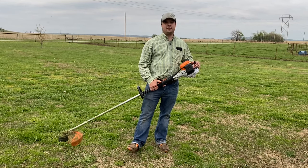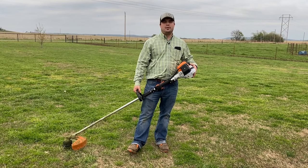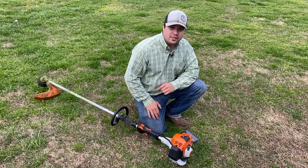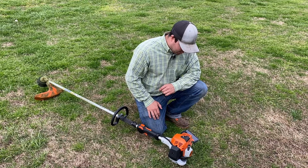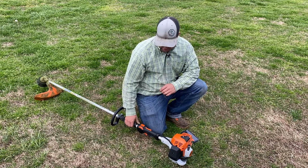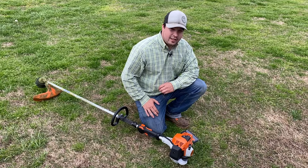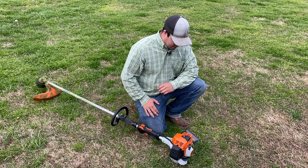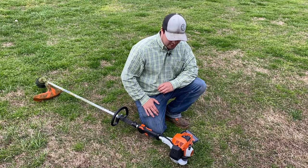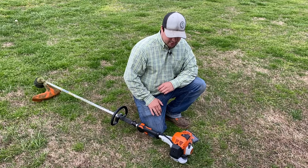Just because of this one feature that it's got, which I'll show you in a minute. It's the STIHL FS 94R. Going over some of the features: it's a 24.1cc engine, 1.2 horsepower, weighing in at 10.1 pounds — very light, nice to carry around for a day's worth of work. It has a 16.5-inch cutting swath and carries 18.3 ounces of mixed fuel, so not the biggest fuel tank but it still lasts quite a while.